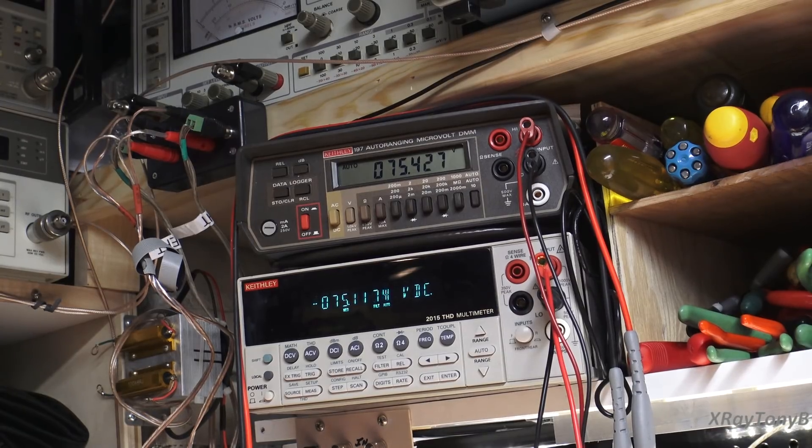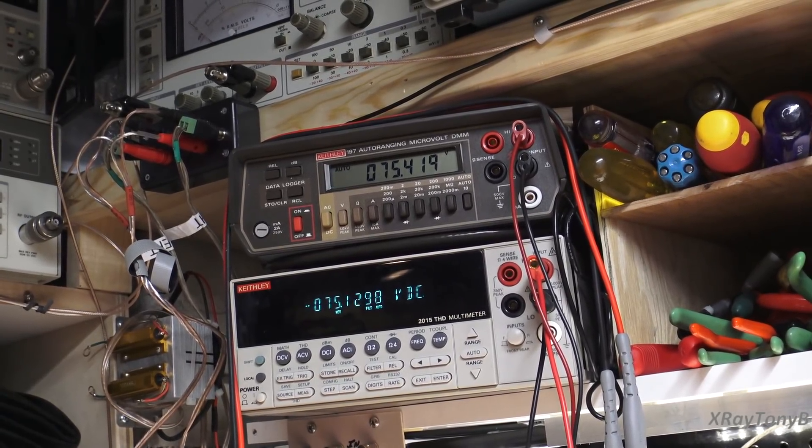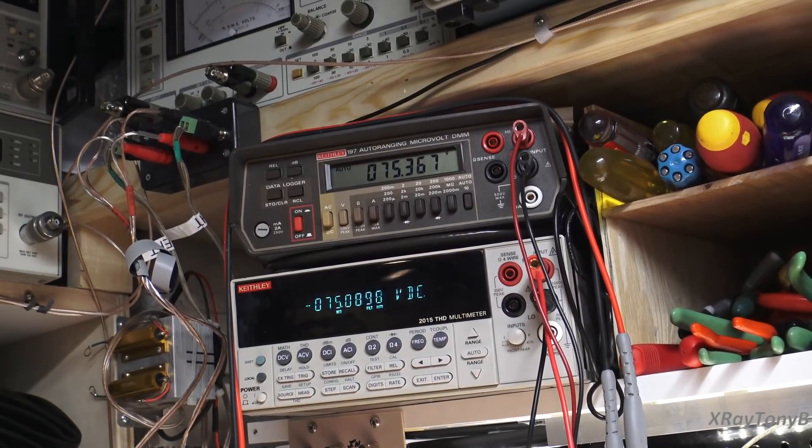So far so good. I have the idle current set on the 2 amps all the way to minimum, and we're not looking at that yet. But we have good power supplies. If our power supplies are working, we're halfway there. No smoke, nothing shorting — we're only drawing 550 milliamps at idle. I would have to say that so far this is working. We don't know about the amplifier sections yet — I did an awful lot of work on those. But we have a good power supply.